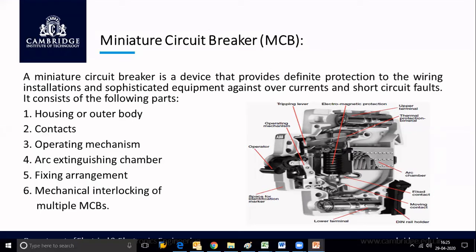You can see in the figure how the MCB looks. In all houses, the distribution board is provided with MCBs. Each and every circuit — whether a lighting circuit or a power circuit — is provided with an MCB. Whenever there is an overload or short circuit condition in a particular circuit, that particular MCB will trip, indicating that some fault has occurred. After rectifying the fault, we can switch the MCB on again to restore continuous supply for that circuit.